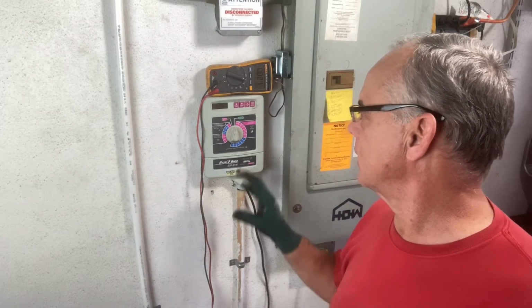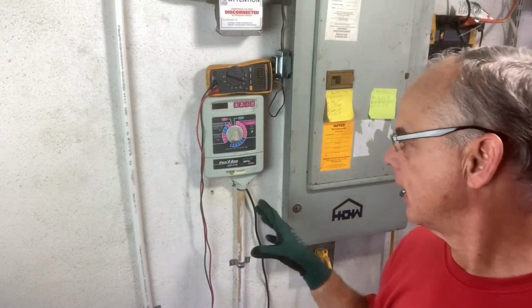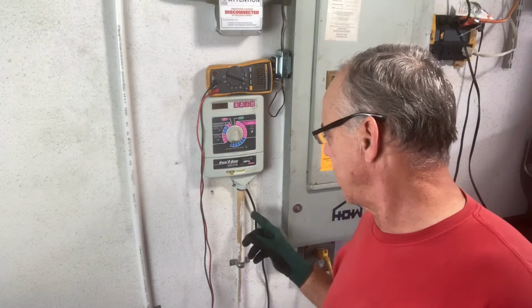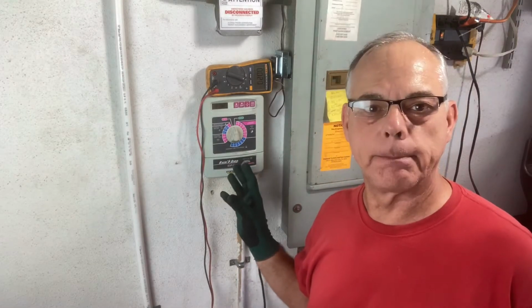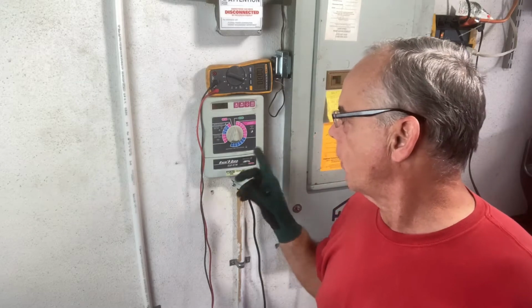And what PR off is telling you, it's an error code, and it's telling you that the sprinkler timer is not getting any power. We have to figure out if we have a bad connection, bad transformer, or just no power, or bad circuit board. So I'm gonna walk you through some tests.